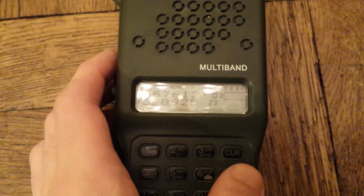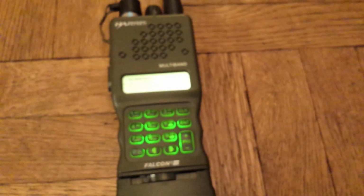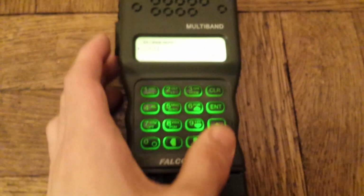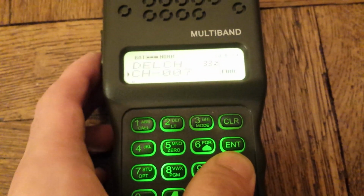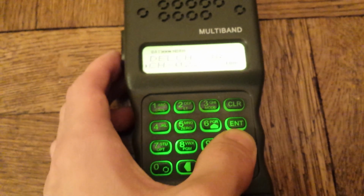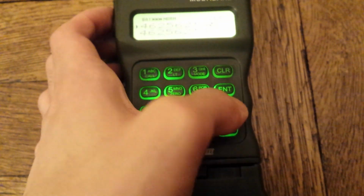As you see here, I have all my channels preset to make it work like a Motorola Talkabout or a Midland, or popular radios that have 22 channels. Thankfully, you don't have to go back to frequency mode to delete a channel. You scroll down to option 33, and it says delete channel. Of course we scroll to channel 23 and press that button again, and channel 23 is gone. As you see here, there's no channel 23 anymore.